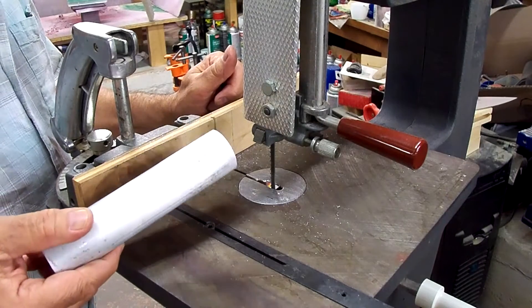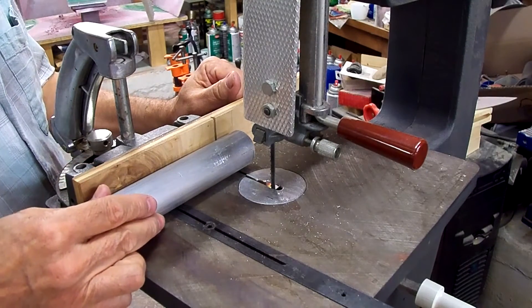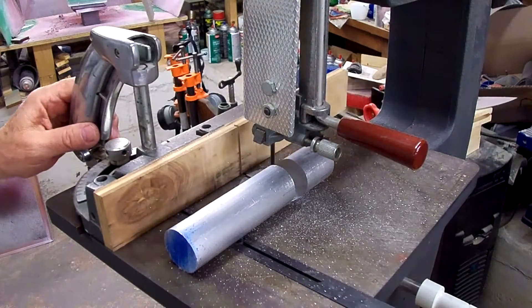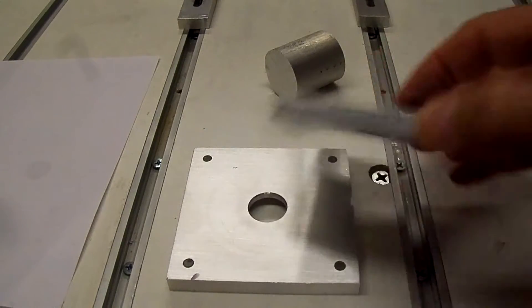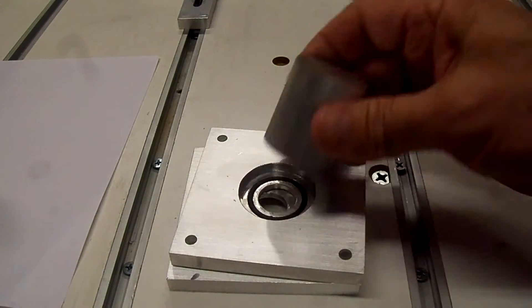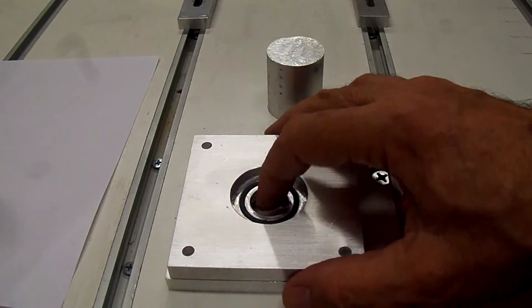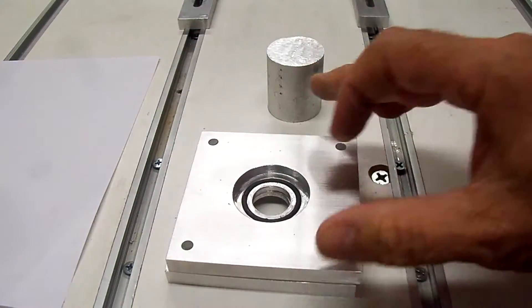I'm going to cut a short piece of aluminum off this round stock here to put in the lathe to make the pin. I've got to turn one end down to three-quarters to fit through this hole in each of these pieces. The other end can stay as is — I think it's an inch and three-eighths now and it'll fit into this inch and a half recess. I'll probably just clean that up and turn the rest down to three-quarter to go through the hole, which doesn't need to be very long because you've only got about a quarter inch, eighth inch on each side.